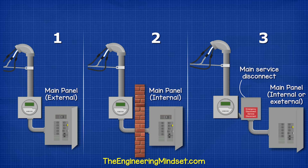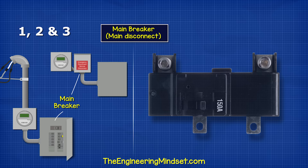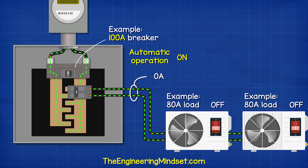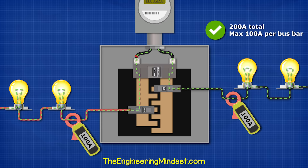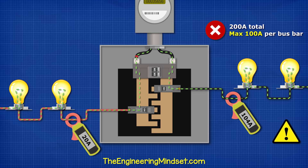With scenario three, our main disconnect is outside — we may or may not find another breaker in the main panel. The main breaker is a double pole breaker, so both hot wires are connected or disconnected at the same time. We can manually flip this on or off, but it will automatically trip if we exceed the current rating printed on the latch. This provides our main over-current protection. Notice this one is just two 100-amp breakers tied together — that does not quite give us 200 amps though, because if just one bus bar uses over 100 amps, both breakers will trip together.